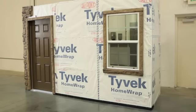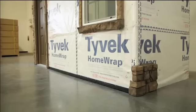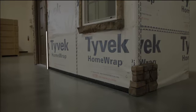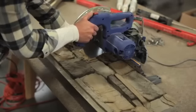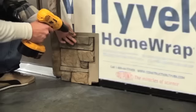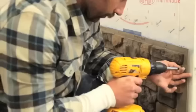Because we know this wall starts with trim pieces on the left and ends with corner pieces on the right, the trim gets installed first, and the corner on the first row gets installed next but only loosely tacked on as it will be removed later. Now proceed to measure from the right side corner to the trim on the left side to determine how many full panels you will need — the remaining space will be a partial panel that will need to be cut. Once the first panel width is determined, make a straight cut on the left side of the panel and proceed to butt to the trim. Install all panels across the row, screwing into the tongues on the top and right edge of the panels.